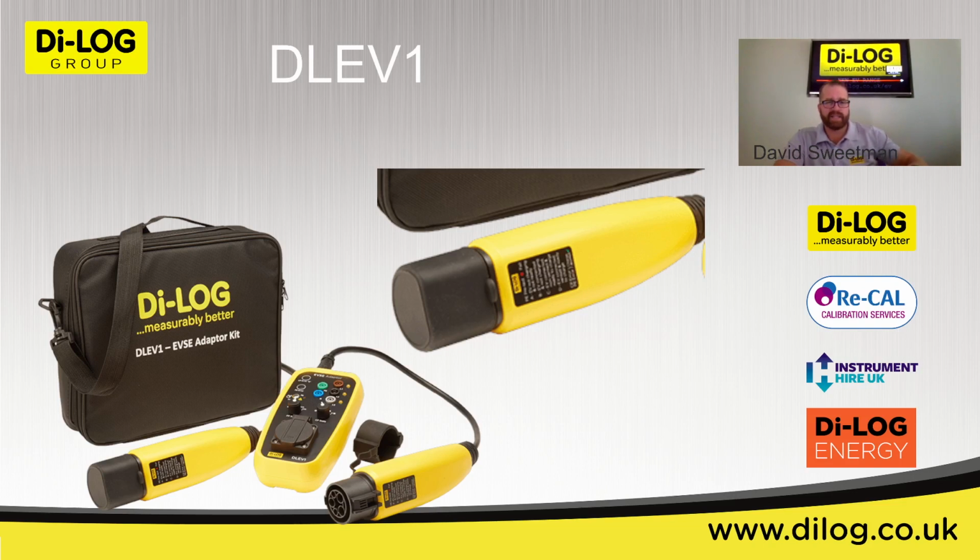And it's got several functionalities, including enabling you to plug your multifunction tester in it to perform live testing. However, it is a standalone tester itself, or checker, so that it will indicate things like proximity pilot, which is the lead resistance. So each EV charge lead will have a maximum current capability, and that can be set within the EV charge adapter, so you can test that an EV charger is not going to overrate the lead that it's plugged into. The EV charger will actually know what lead's plugged into it from a signal within the charge lead itself, and the EV adapter will simulate that as well.